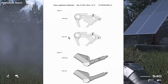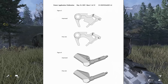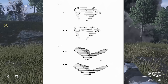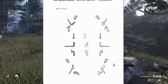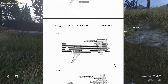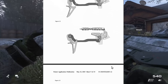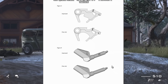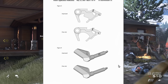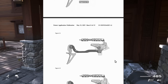The existing design is referred to as prior art, and he has something called an improved design throughout the document. He has a safety lever that is compatible as a retrofit, which makes me feel like he was working with Sig to develop this. How it works is there's a little notch in the sear that is captured by a new safety bar, so it can only rotate downwards with this little protrusion if the bar is in a certain position. He writes exactly how it works.